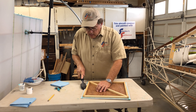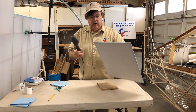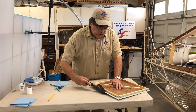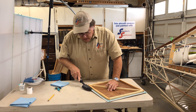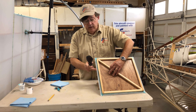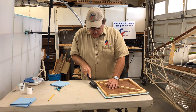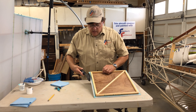Now I'm going to come to the edges and just roll them with the iron to get any remaining little bubbles and make sure this is adhered nicely to the edge of the plywood. Remember we talked about 10% shrinkage — when I drew my line for this lip, I had the fabric about an eighth of an inch longer than necessary, knowing it would shrink back and tuck nicely inside that corner to give it a nice finished look. I like the crisp look of the fabric coming to a nice terminating point inside there.